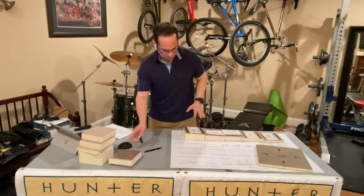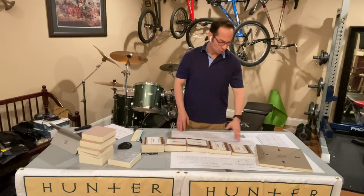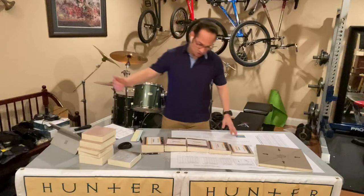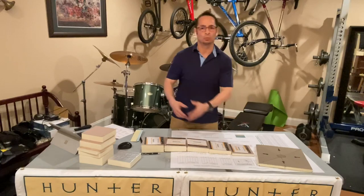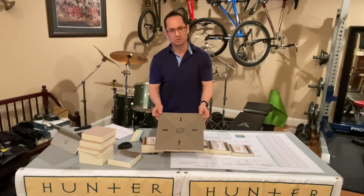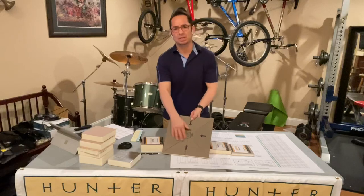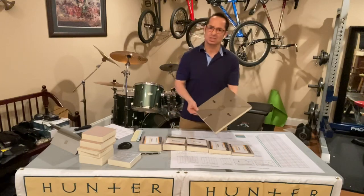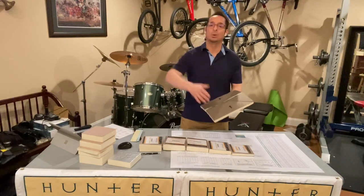It's coming at you. Also, taper, okay? Why do you have tapered polyiso? Well, it goes from a half inch all the way up the roof, and then you start stacking it, and that is to create positive drainage, positive water flow, either off the roof or into the drain. You also have sumps that you can get up there. This is a very small sump. It's either a 4x4 or a 4x8. Any pitch that you want it to be, quarter inch on 12, half inch on 12, 3/8 inch on 12, and that is the slope of the taper. The taper is made with the polyiso.